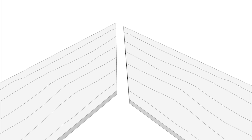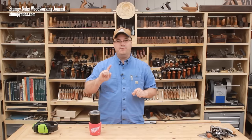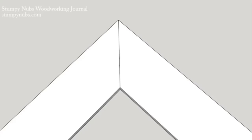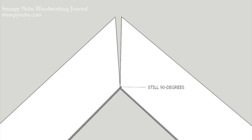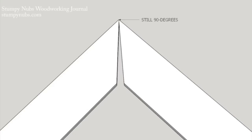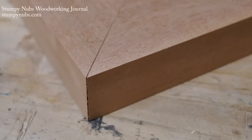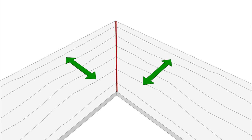You cannot permanently tie these two slabs together because while this side will grow wider, this side will not grow longer. Therefore the seam between them must be able to move or the end grain half of the joint will eventually crack. A miter joint is different — while the grain still runs in different directions, only the ends of those fibers are connected. Theoretically both halves of an end grain to end grain joint should grow and shrink together, but as the two halves of the miter joint swell wider without also growing longer the outer corner will try to open up. Likewise as the two slabs shrink narrower the inner corner will try to open up. Wide slabs contain many fibers and the effect is magnified, and movement will eventually compromise any glue you plan on using.